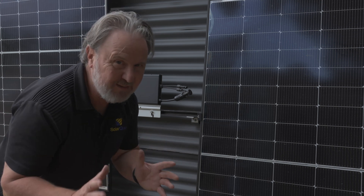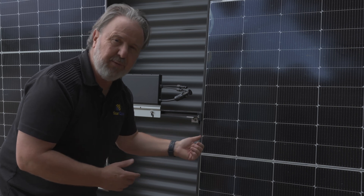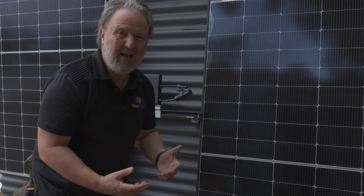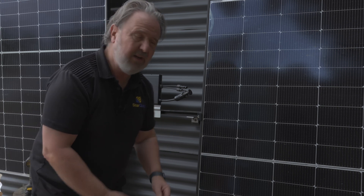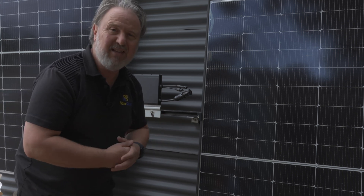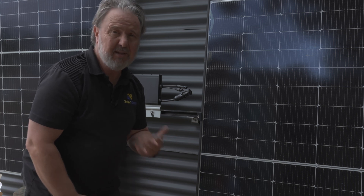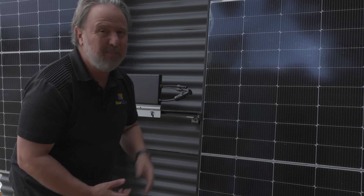What's really interesting is that these panels are different — one's a 415 watt and one's a 370 watt. It actually doesn't matter with microinverters. The panels can be all different types: different cell types, different capacities, different voltages, as long as they're within the operating window of the microinverter. The microinverter will convert to AC and parallel its output with all the other microinverters. It's one of the great advantages — for expandability of a system, you don't have to keep matching your panels. They might look nicer if you did, but you don't have to.